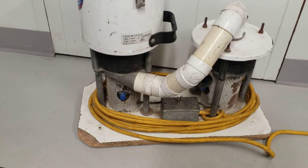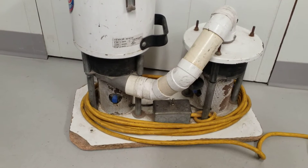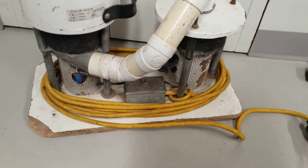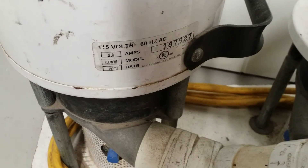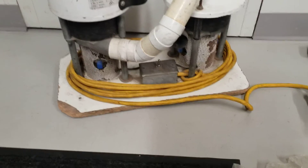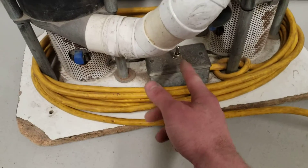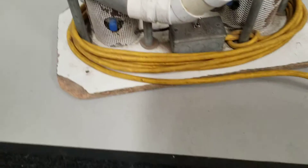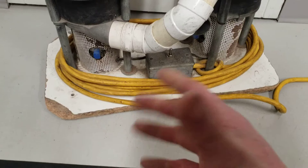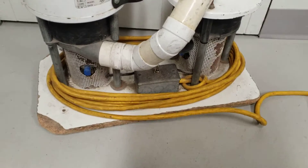The problem is these motors are essentially Silent Master S5 motors, and the Silent Master S5 is rated at 27 amps of electrical consumption at 120 volts, which this machine is. So trying to plug this into some lady's living room electrical circuit means you'll trip the breaker a lot. My modification — this originally was just a toggle, like a big heavy light switch — I thought: if we could get these motors to start in electrical series and then switch them into parallel, that would almost be like a soft start.